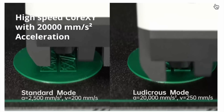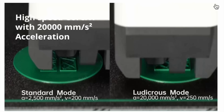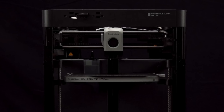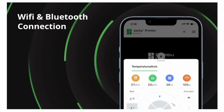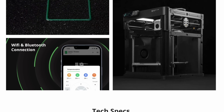With all that missing, what does the P1P still have? It's still an insanely fast Core-XY printer. It retains the 20,000 mm-per-second squared acceleration and 500 mm-per-second maximum toolhead speed of the X1 and the X1 Carbon. It still has ludicrous mode for extreme high-speed printing. It still has the 256 x 256 x 256 mm build volume of the X1 series. It still has an all-metal hot end with a stainless steel nozzle that can reach 300 degrees Celsius. The bed only goes to 100 degrees Celsius, though — the X1 and X1 Carbon can get to 110 or 120 degrees Celsius, depending on whether they're using 220 volts or 110 volts AC power. It still has vibration compensation and pressure advance, Wi-Fi connectivity, and the ability to use and control the AMS unit for multi-material and multi-color prints. Plus, the slicer and mobile app still work with it.